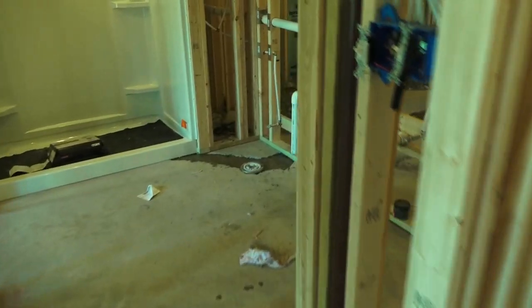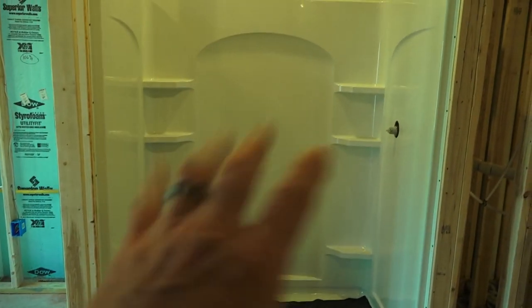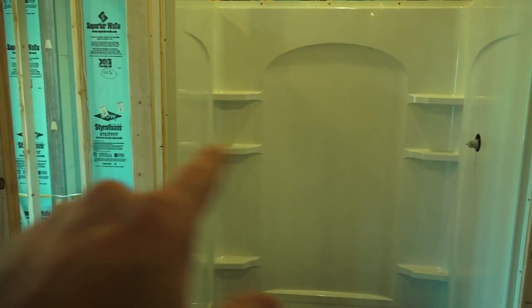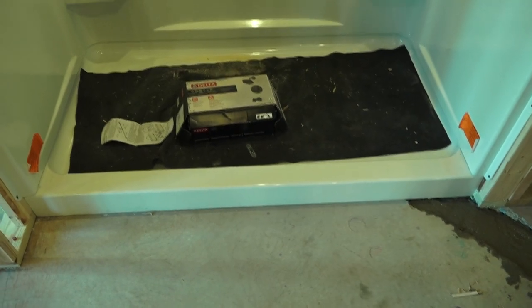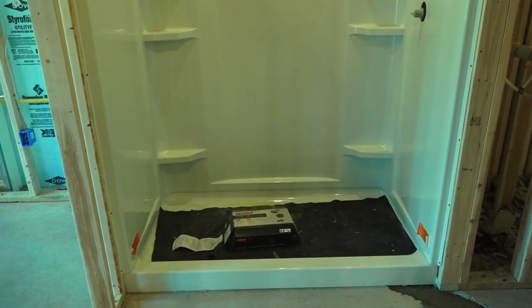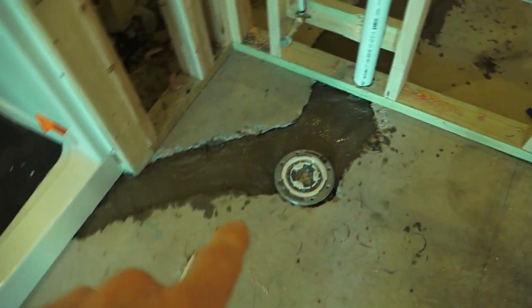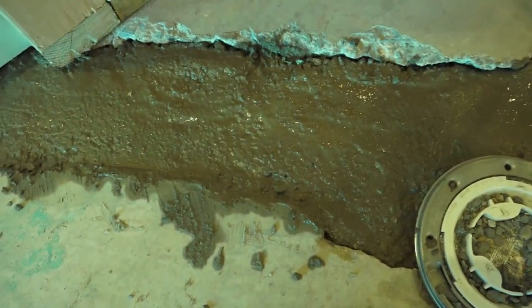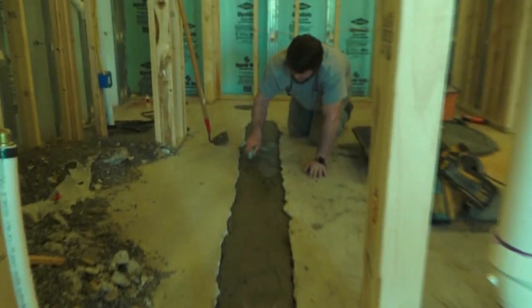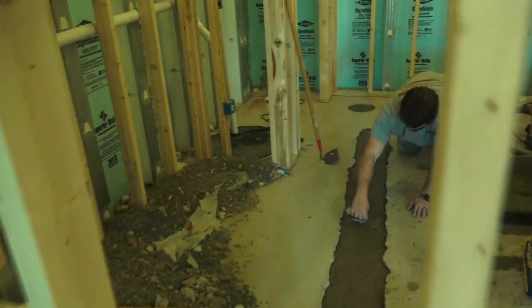We got the floor concreted back shut and the shower's in position. There's the five-foot shower that we purchased — it's a Kohler Sterling five-foot shower. It comes in four pieces: the five-foot back panel, two 34-inch side panels, and the five-foot by 34-inch shower pan base itself. A real nice unit, perfect for basements where you can't get a one-piece five-foot shower in — which 95% of the time you're not going to be able to. You can see our trench, we have our toilet flange in now, the concrete's wet here. We filled it in and our flooring will go right over top of the patchwork.